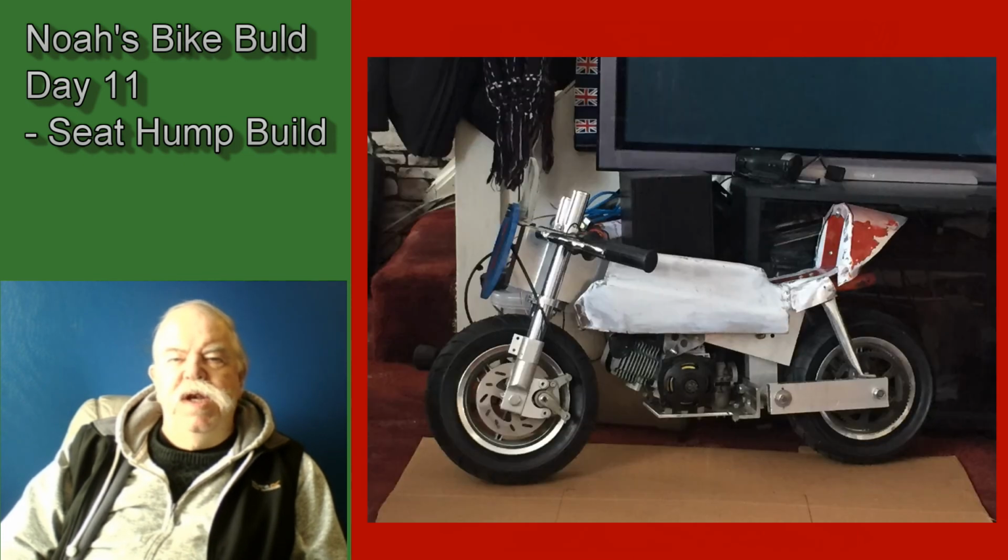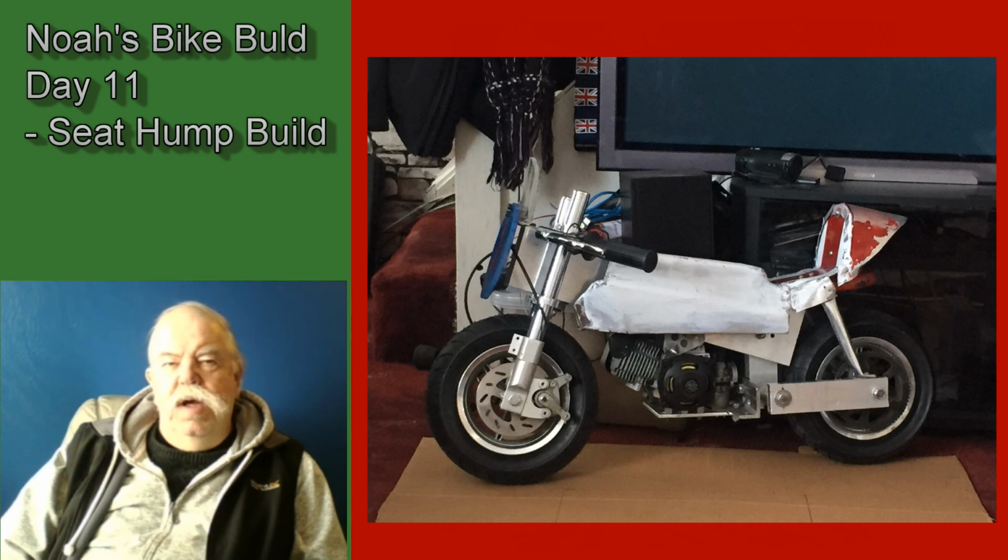I'm going to cover this seat with waterproof race seat padding. It's adhesive, can be shaped, and it's used on lightweight seats for true road racing, but I like the workability of it. I like the fact that you can file a radius on it, shape it, and the glue seems to stick very well. So the seat padding is going to be on the vertical, on the horizontal, and up slightly over the front of the tank. It's going to be stuck to the parts where I see it as a pressure point issue. That's the plan.